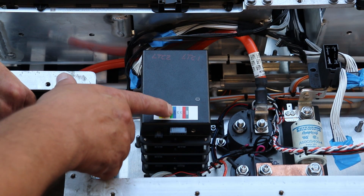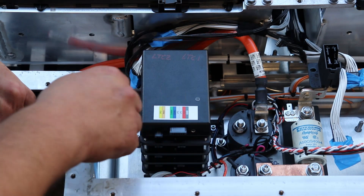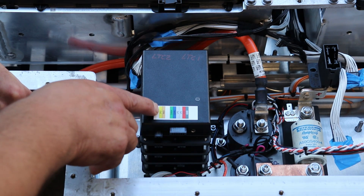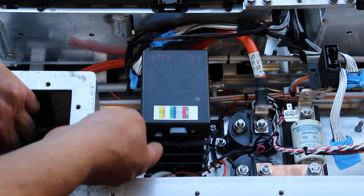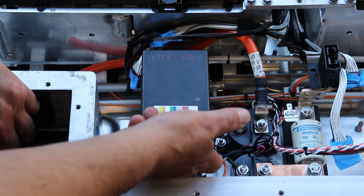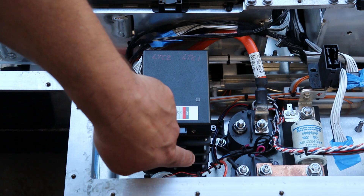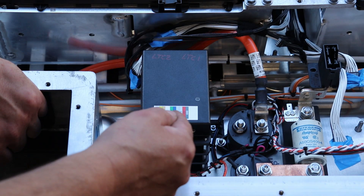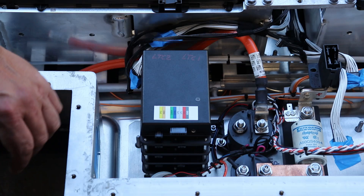Then you've got CAN high and CAN low for your CAN bus if you want to see information or pull any data. You also have IPO and IMO — basically a twisted pair that goes to the next satellite module below it. That's how the master communicates to the satellite modules — just two wires jumping from one to the next. Super simple.